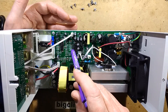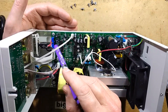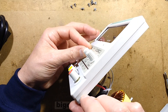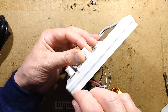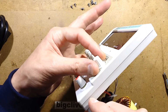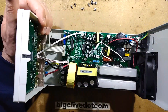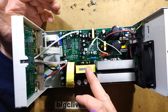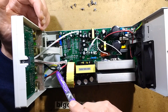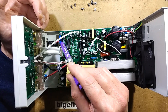We've got quite a lot of support components around here, and what says M324 - I'm guessing that's an LM324 quad op-amp. We've got two little trimmers which I'm guessing give coarse and fine control over voltage and coarse and fine control over current - you start with the fine knob at roughly middle position, tweak the coarse trimmer to roughly the voltage you want, then fine-tune it. These knobs affect directly what the feedback from the switch mode power supply is doing. The displays are basically just dumb displays measuring current across a shunt and voltage across the output, fine-tuned with these two trimmers.